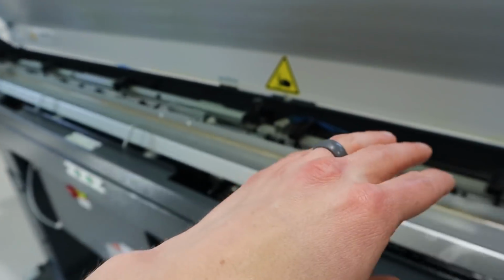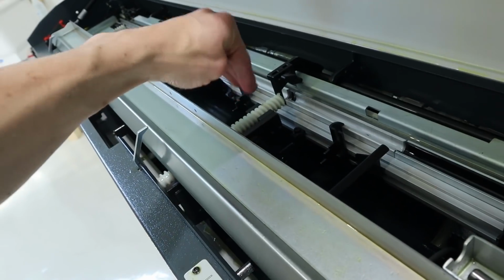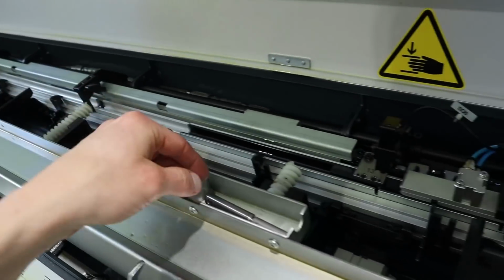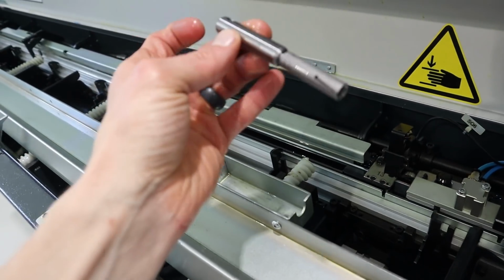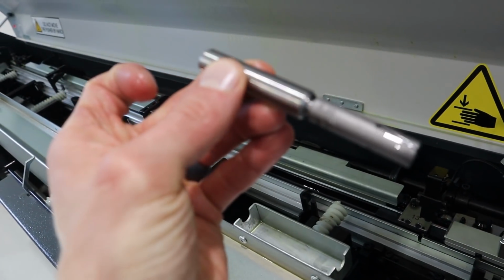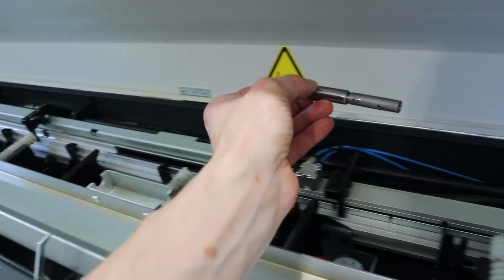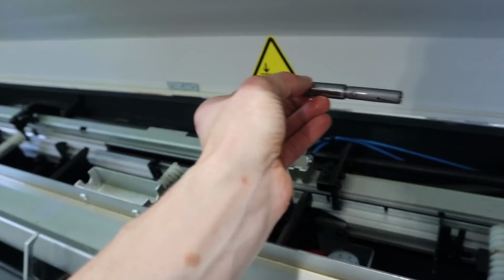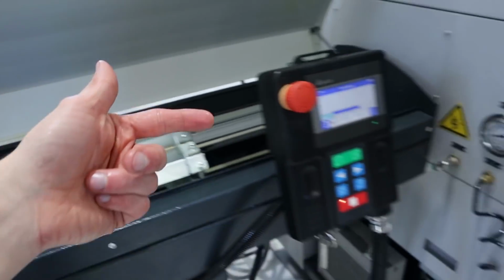Over here, this is the bar feeder. Bars line up on these screws. Bar, bar, bar, bar, bar, bar. And then there's a collet that goes right here. This is my 1/4 inch or 6.35 millimeter. This will stick on the end of a bar and push it forward and follow. I've put in the 3/8 one, which has gripped the brass rod.